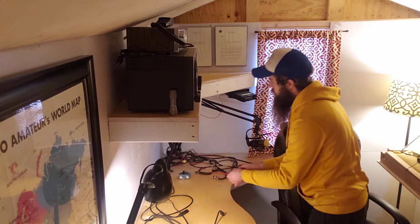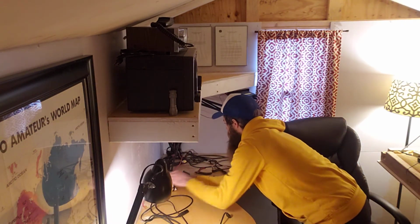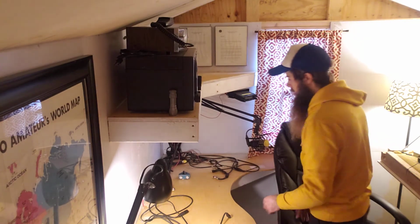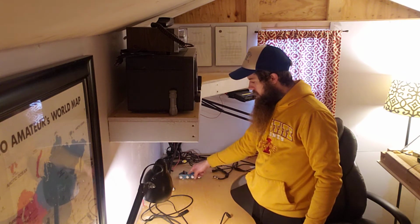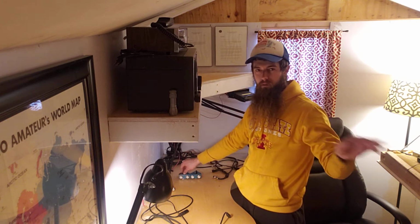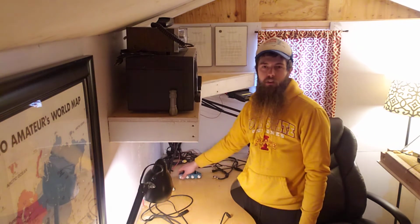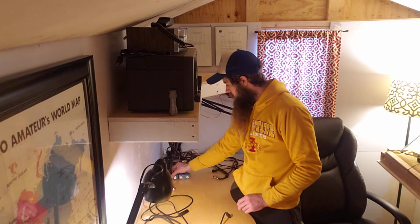Okay, here we have a ground wire, and I think this is going to go to our antenna tuner. So we'll just run that over this direction. And this ground wire is going to go to our radio, so that's in an okay location. I'm not sure what to do about my coax switches just yet, because I've got 2 of them, and that's something we're going to have to figure out. One of these is for bypass, so it'll go either to the antenna or to the dummy load on the output, the last step in my chain. And the other one is on the first step of my chain, and that either goes to my radio or my transceiver. So we're going to have to draw that up and figure out the best place to put those when we're figuring out cable lengths and everything that I need out here. But for now, we'll just set those by each other right here.